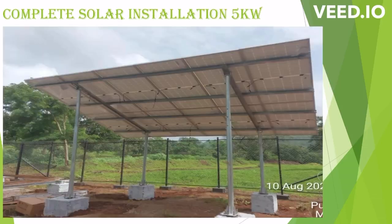Finally, the complete solar installation will look like this. Four numbers of pedestals along with the solar structure will be supplied by the supplier and installed on top of the foundation. The solar panels will also be supplied by the supplier. The solar installation work must be started only after getting the foundation bolt and template. Without the foundation bolt, template, and approved layout, there will be a rejection at the end of the day.